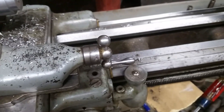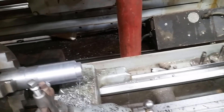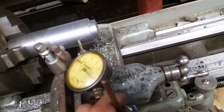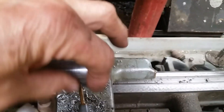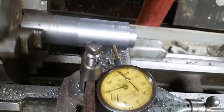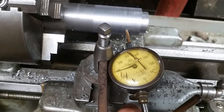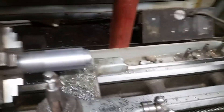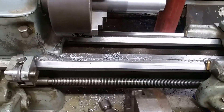I've turned that and basically just skimmed it off so that it's perfectly concentric and not out of round. I'm going to say that's pretty good. I think I've got more slop in the headstock than anything else, but that works pretty good. I'll pull this back, get this to the back side of the tail, and then mount this.